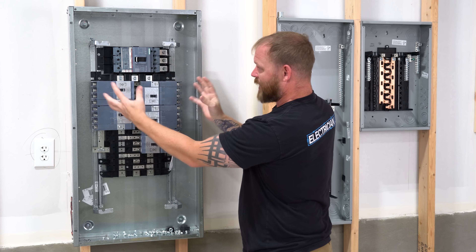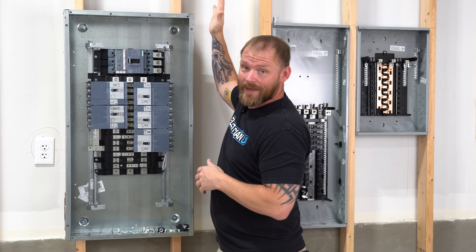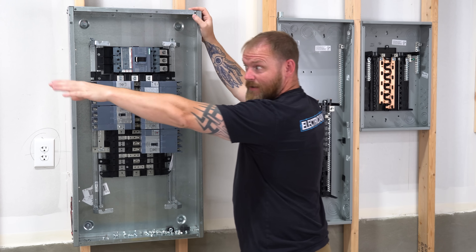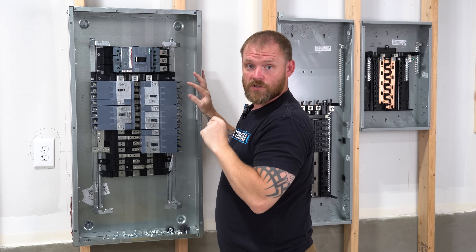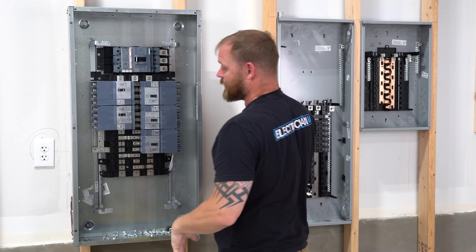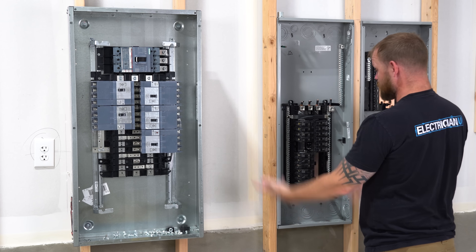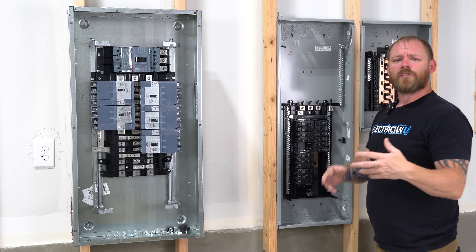The interior is this panel board, breakers, everything. The interior comes usually in a different box, and then you buy a cabinet — you'll have a panel cover as well, but it's all separate pieces that you have to assemble. On a commercial job, I'll have like seven different panels to put in — I'll mount all of the enclosures first, then come back a different day, take the entire interior and set it in there and bolt it all in place, start putting all the breakers in. It's largely built out in the field, whereas in residential, most of the time I just pull this load center out and pop it in and run my wires into it.